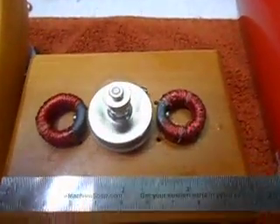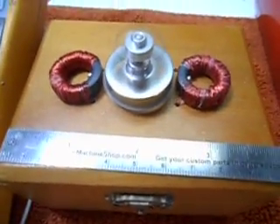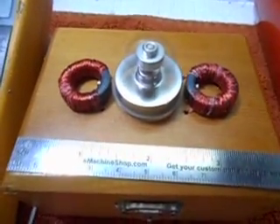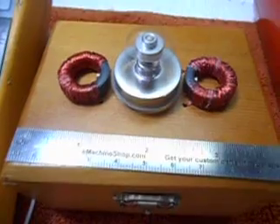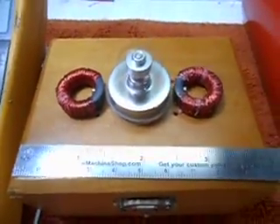This is a refined version — much smaller and much quieter. The clearance in this motor is only about 5 thousandths of an inch between the coils and the magnets. Could have made it closer, but it's good enough for what we're doing here now.